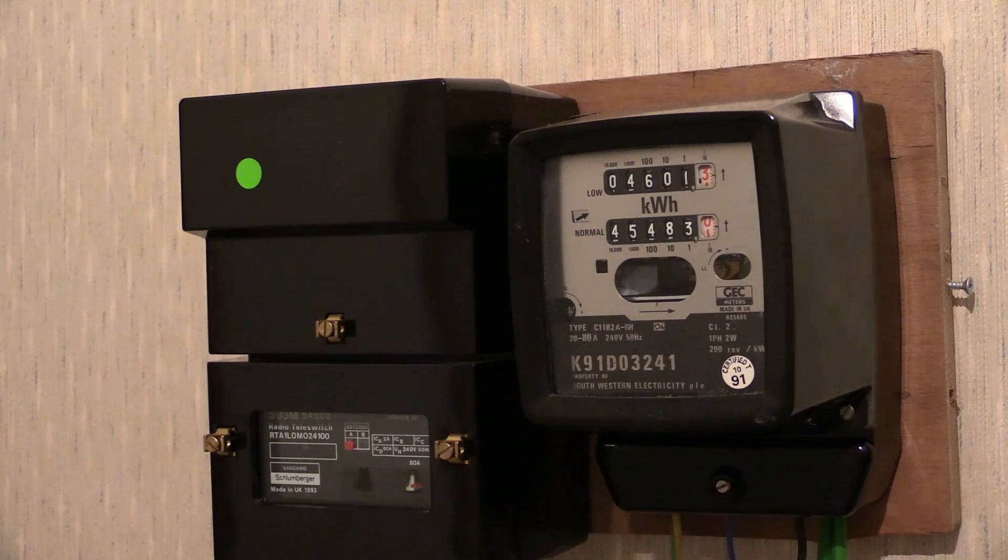In a proper household where you've got the storage heaters and the immersion heater and all that lot, when your rate changer first turns on, everything that's going to clunk in - all your storage heaters and the immersion heater - that's pretty obvious. But over the night, your wash cycle is going to come to an end if you've got the washing machine on, tumble dryers aren't going to last forever, your storage heater is eventually going to come up to temperature and switch off, as is your immersion heater tank. So over the course of the seven hours allocated on Economy 7, that load wheel in the electric unit would speed up and slow down, and more or less towards the end of your allocated seven hours, it would hardly be going around at all.